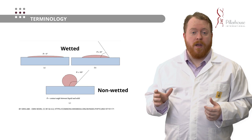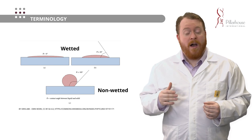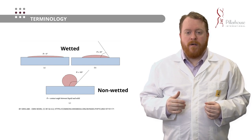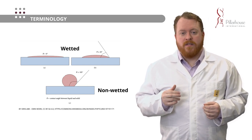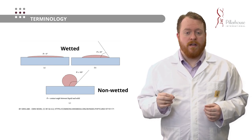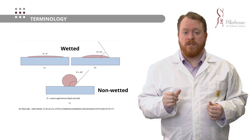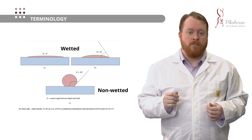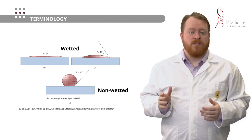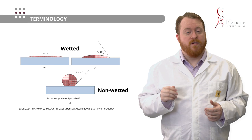In terms of wettability, we're analyzing the interaction of that surface tension and that surface-free energy, which defines how much a liquid droplet will spread out on a surface. We have some diagrams here showing different contact angles, which is the metric we can use to determine how well a liquid wets to a surface. A very large contact angle shows a very poor wetting scenario, whereas low contact angles show good wettability where the liquid droplet spreads out more — and in terms of solder on a nozzle we would look for very low contact angle.